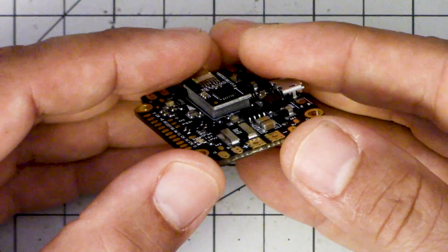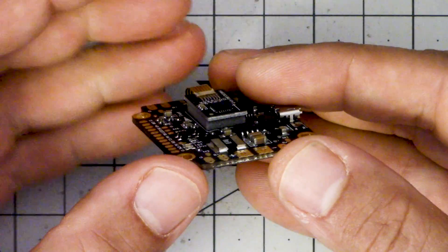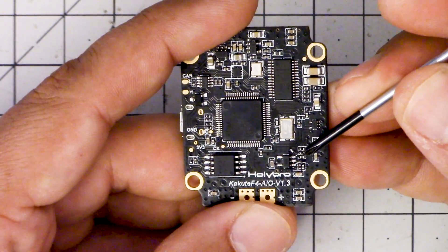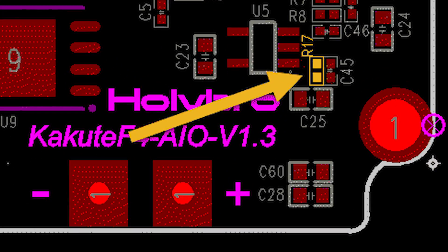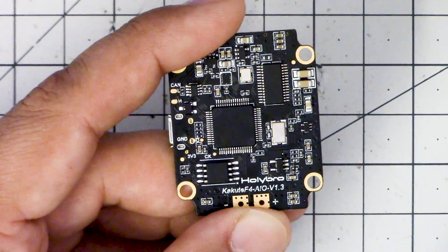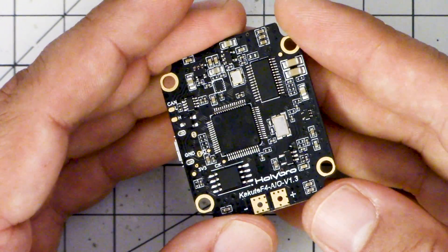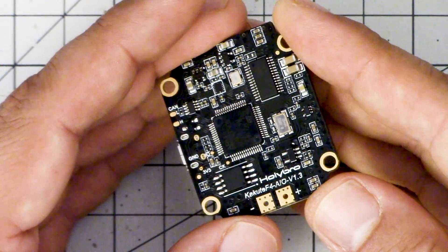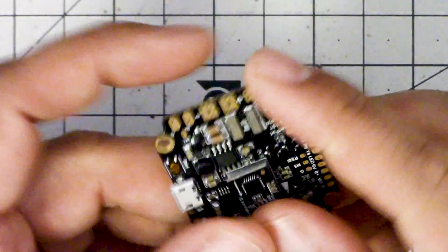The solution is that we need to change the resistance of either the shunt resistor or the gain resistor. Now the gain resistor is this little — I'm gonna have to just show you the schematic because it's so freaking small I can barely even show it to you on camera. You could change the value of that if you were very good at soldering, but for me and for almost all of you, there is no freaking way you would succeed. I mean, I couldn't even have a soldering tip that fine. There's an easier way.